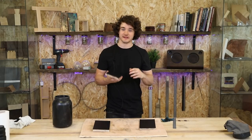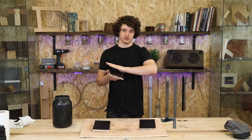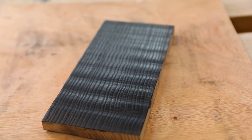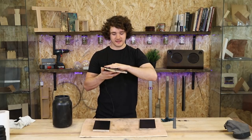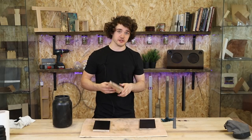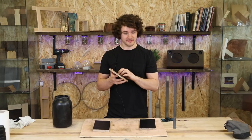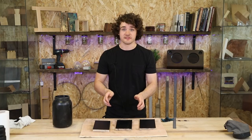Although I said at the start you don't really have to sand these panels, what you should really do is make sure they're perfectly flat — make sure they're planed and there aren't any ripples left over from a thicknesser or planer — because if you look along the length you can see there are bumps on there. It's smooth, doesn't need sanding, it just needs flattening out. But it depends on the look you're going for of course. It's a really nice finish, it feels amazing — you could literally just touch it all day. So there we go, I hope you learned something in this video. See you in the next one.